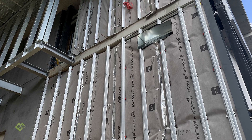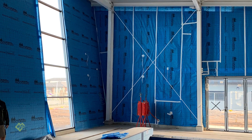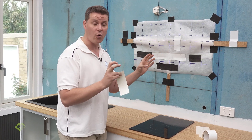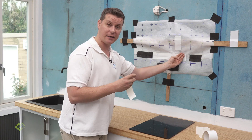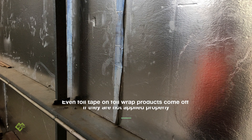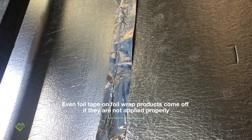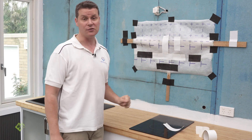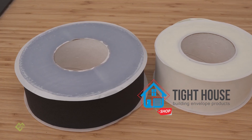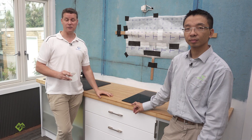With the application of these tapes, which are designed for the building envelope for wraps or panel systems, it's super important that you completely push — we call it 'dewater' — the tape so that it makes a spectacular adherence to the surface you're sticking to. If you do not dewater the tape and stick it down without actually pushing it, the level of adherence as well as the longevity of the tape sticking in that position is not going to be there. There must be some force that enables the tape to make its connection to the material. For more information and pricing for these and other products, go to tighthouse.com.au.